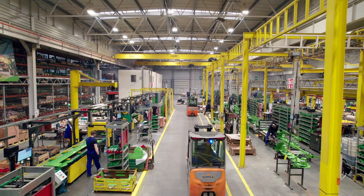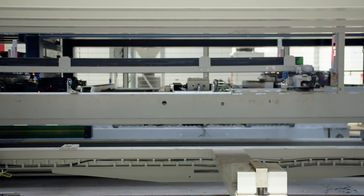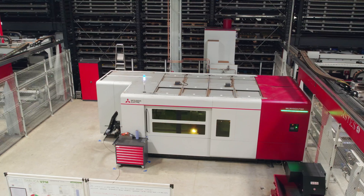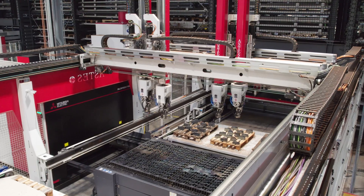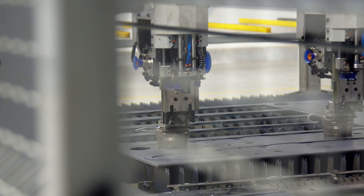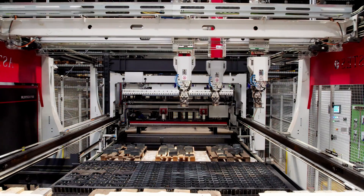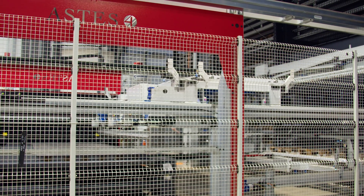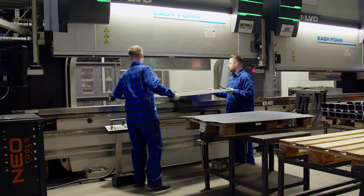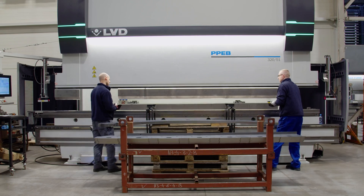Let's see how it all functions in practice. A required metal sheet is taken from the automatic sheet store and transferred to one of two high-tech laser cutting machines, where most of the parts are prepared for the following processes. Automatically stored parts packed on storage pallets are delivered to the sheet metal stock. The cut parts are then transferred to bending processes. On press brakes, components included in the hitch, support arms or conveyors are bent.